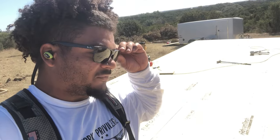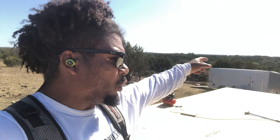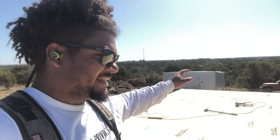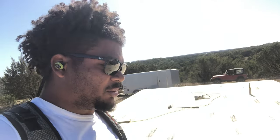All right, guys, so I am done with the Advantech subfloor. Super easy, super simple to throw down. With that adhesive, it just flies. It's easy to get out. I used one and like maybe a quarter of that can. I think I did 3 sheets with that last can. So one can did 98% of this. So super, super simple process.